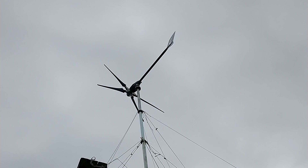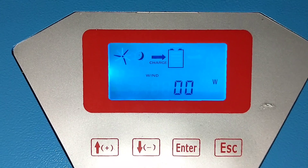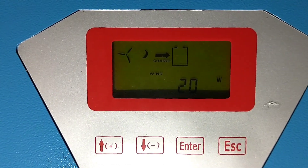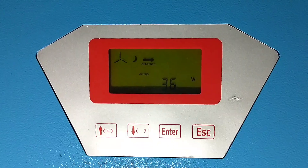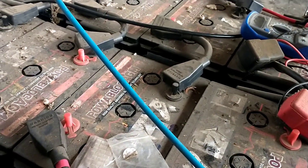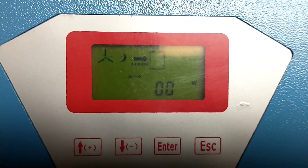We're just going to have a look at how much it's generating, but it won't be a great deal — at least it's better to trickle than do nothing at all. We're hooked up to the batteries in a 24-volt configuration. We're generating a very modest amount but we are generating, so we could theoretically trickle charge all night with a gentle wind of probably 10 mile an hour or less. We're charging at 24 volts, which means it's going to be a lot easier for the wind turbine to push into the battery at 24 volts, but it means the batteries won't be balanced.